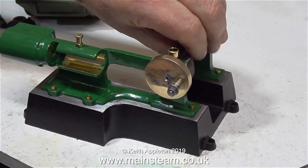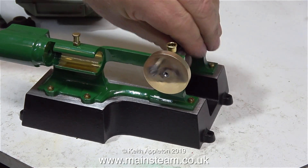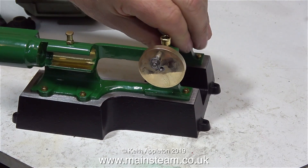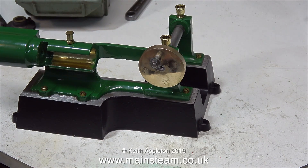Now the crankshaft is as near to perfection as I can get. I can rotate it by the shaft itself with very little effort, and it's certainly not a rattle fit. I've spent quite a lot of time just rotating the crankshaft to bed it in, and it got even better - it is very, very free.